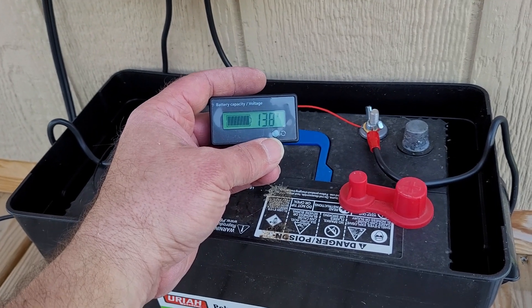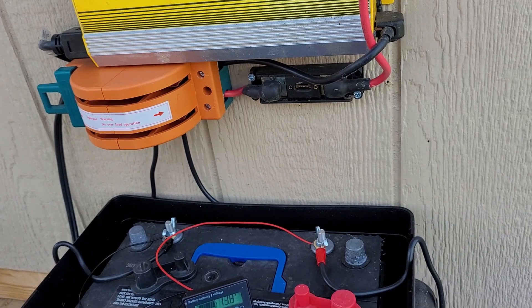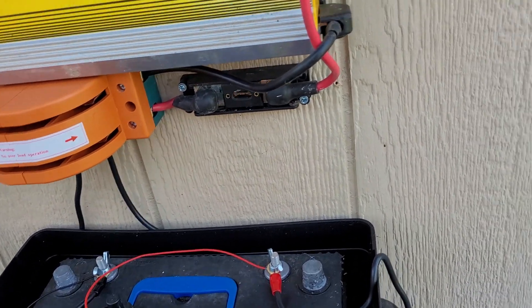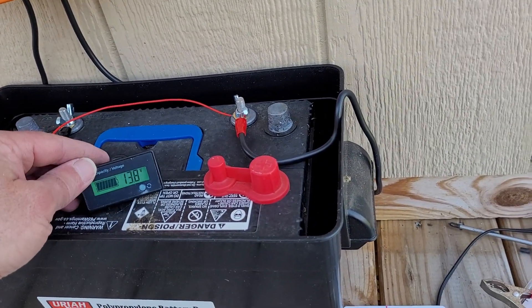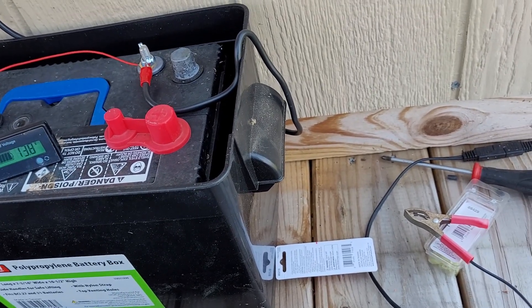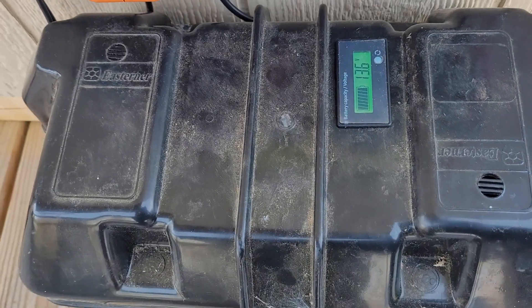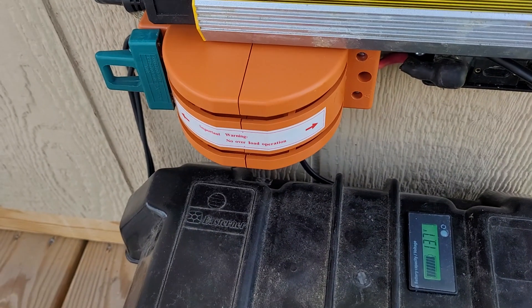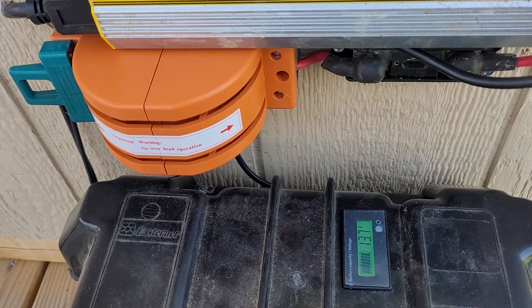When it's flashing green, that means the sunlight is effective but it's not doing anything to the battery. When it's steady green, the battery is fully charged. I've got my little battery indicator on here showing it's 100% charged — clicking it shows 13.8 volts. I thought it should be 14.1, but the solar panel is in the on position right now. That little light on the back of the panel will indicate reverse polarity if it's steady or flashing red. Now all I've got to do when I want to switch over is flip this knife switch — I don't have to take the cover off and swap alligator clamps anymore. I went ahead and discharged it a little to 13.4 volts, switched back to solar, and you can see it come back up to 13.7 — everything is good and charging.